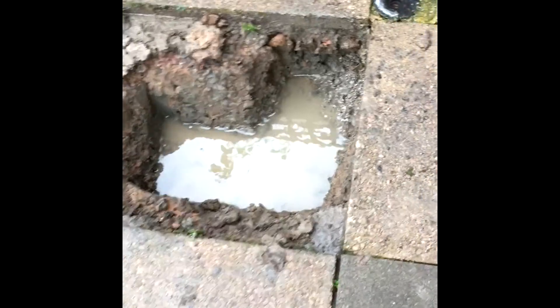The cause? This stuff — clay. If you put somewhere to soak away into clay, it's not going to soak away. It's just simple common sense. British Gas didn't realise this. They put a few stones round the edge and that's it.